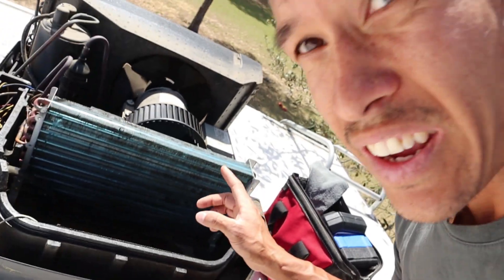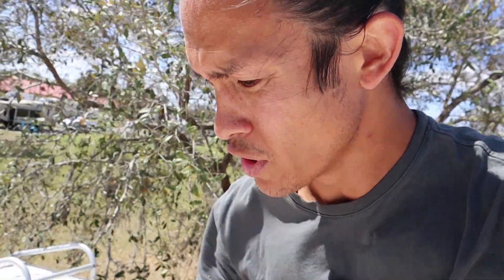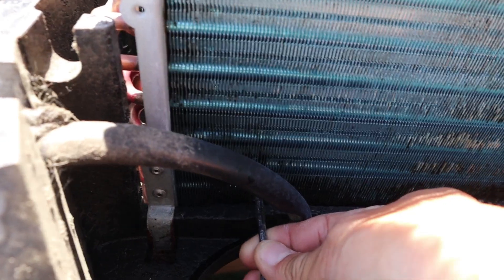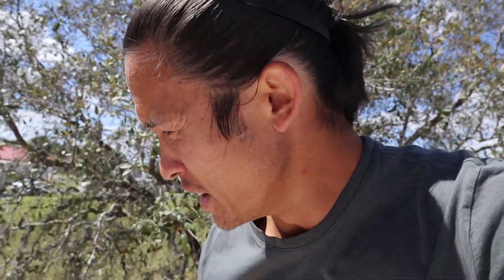That is a dramatic difference. But since it'll probably be another five or six years before you get back up here doing this again, I'm just going to hit it one more time with the coil cleaner to really get it clean. Once those coils are cleaned, we're kind of done up here on the roof. Just make sure you put back the thermostat wire by gently putting it back in through the coils, then put the cover back on, put the shroud back on, put the screws back in, and you're done up here.